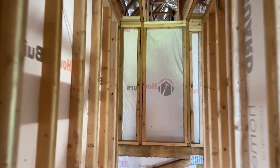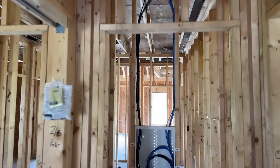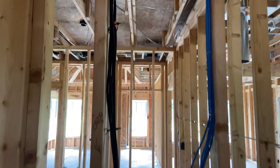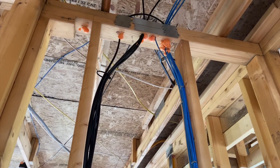Finally we'll head back downstairs and take a look at the structured wiring cabinet. We have everything wrapped up nicely until we come back in the future to terminate. You can see the cables are nicely tucked and we fire blocked and nail stopped everything.